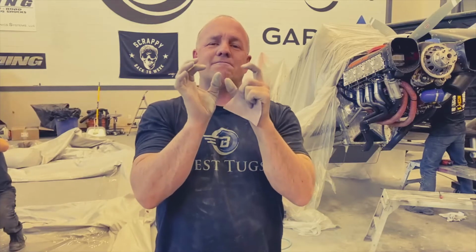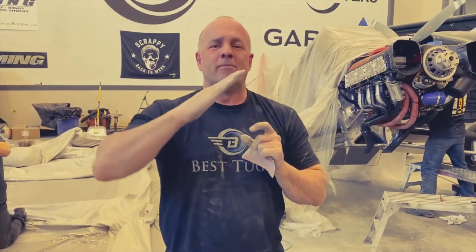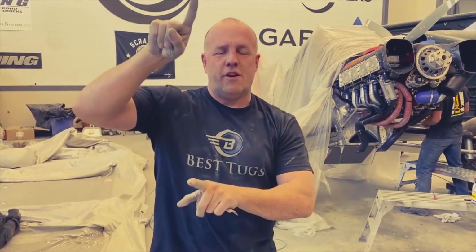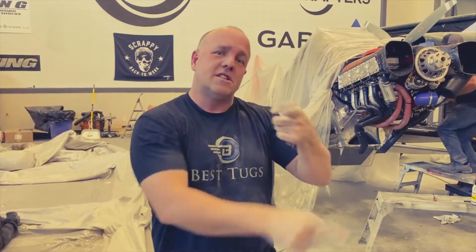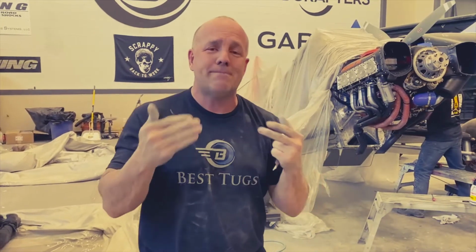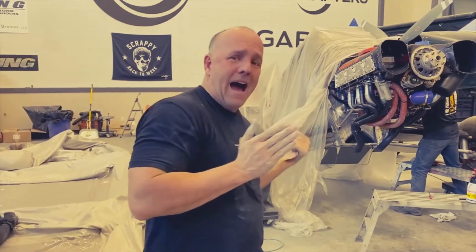And if you have equal pressure, then the dial that goes from hot to cold adjustment is very linear and flat. A lot of people will do two different NACAs, sometimes in two different locations or on the same location, opposite sides of the fuselage, but because the air swirls one direction off the prop, you might have to turn the dial all the way to hot. And if you barely move it, it goes ice cold because one NACA has so much power. When the two blend, it sends the pressure back the other way.